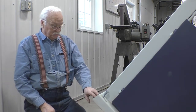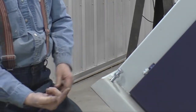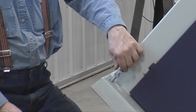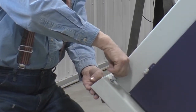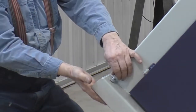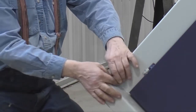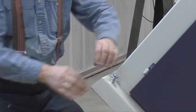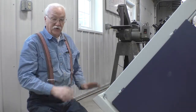So this is how this is going to work. I have a nut welded to the underside of this thing. So when this thing sits on it, it's going to push up on the nut. So all that weld has to do is hold the nut in place. Then this thing will screw down, and I can put a wrench on the top and we'll screw down until it just touches the floor to take any wobble out. Not supporting the weight, just taking the wobble out. This will support the weight. And then this nut tightens down, like so. This nut becomes a jam nut that jams the bolt in between the metal. This height won't change and it should work real nice.